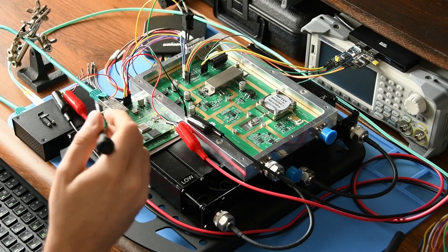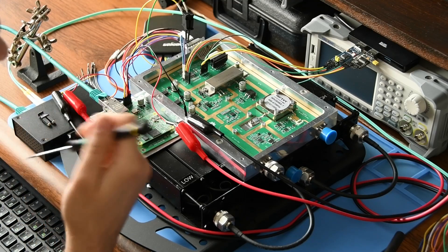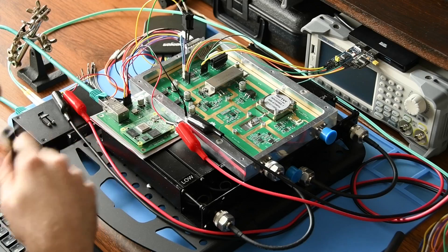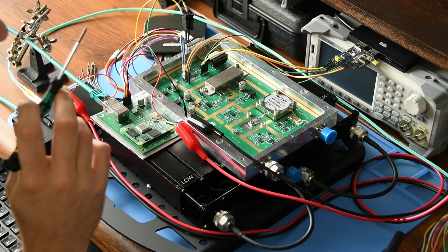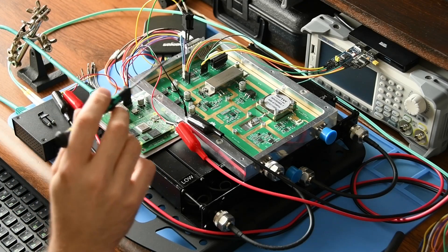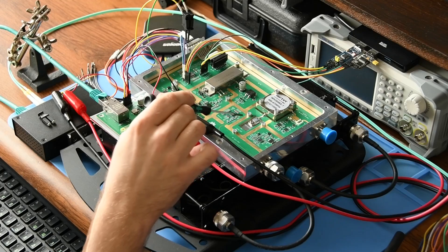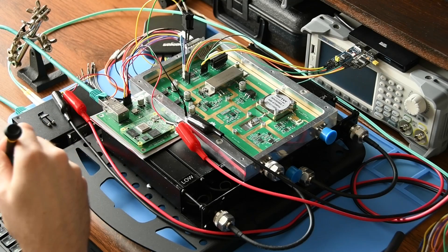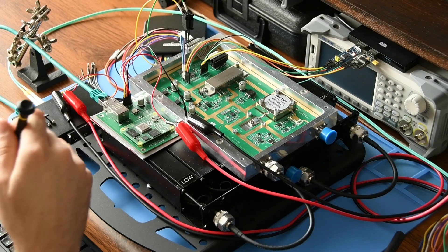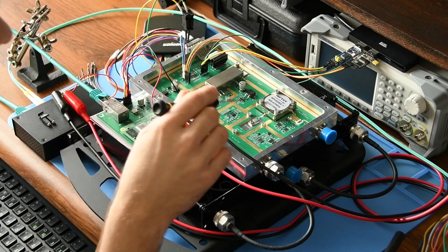When the baseband unit — the device at the other end of the optical fiber — detects a failure, be it a load fault, a broken feed line, or whatever, that event can be detected. You get two things: the power that comes back is dissipated at the dummy load, and you get a warning over the telemetry channel. You can tell at the baseband unit level that something is wrong because you've got elevated reflected power detected at the directional coupler.